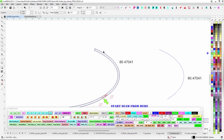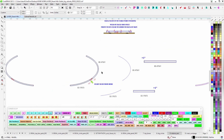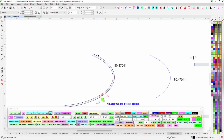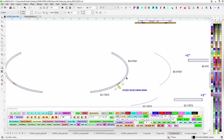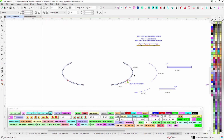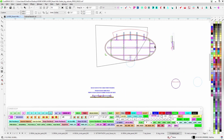That way, that gives you the ability to just weld this together on your table, free form, make sure it's strong. And then later we can put it on there with lords and everything and make sure it's nice and strong. I think it's a good solution. That way you can do these separately, get them ready, and then deal with any heat things. You can sort of tweak them, and then we'll have a nice strong bond, and it's like a component you can set aside. And when you're all done lordsing, you're not having to manhandle this and try to tack weld this and then jack it all up.